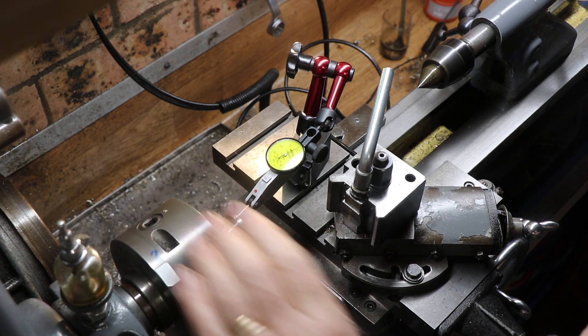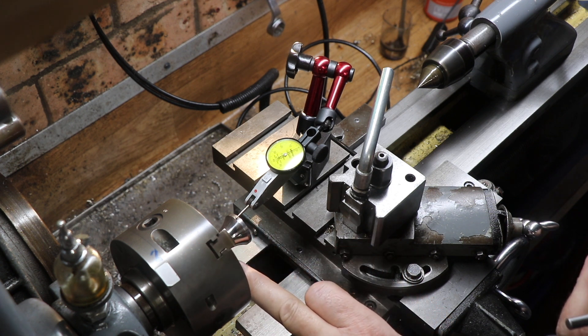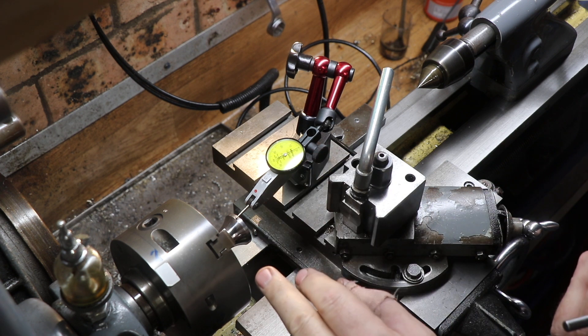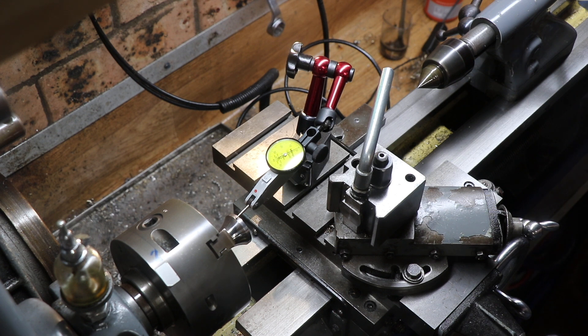How good is that Grip True chuck! They're expensive, but I was lucky enough to get this one with my lathe. I would say absolutely they're worth the money. What you can also do is if your jaws become bell-mouthed, you can clean them up — they don't have to be done in the chuck or anything — and then you just center it with the back plate and you're good to go. I only just learned how to use it last couple of days and now I'm using it all the time. I absolutely love it. I hope that was useful — bye for now and see you next time.